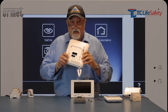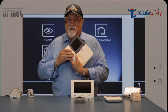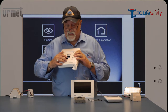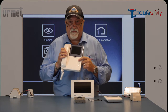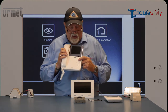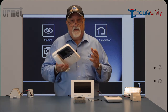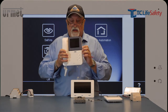S1 and S2 would be used if you have a slave unit — you can have one additional console that acts as a slave, and that carries power and data out to the slave unit. Then X1 and X2 is a hardwired connection between this unit and a driveway, door, or gate opener. You have to hardwire that together, but the key and surveillance mode both work without any extra wires. So you'd have four wires between the master and slave console and just two wires out to the doorbell.